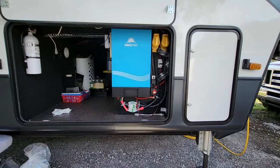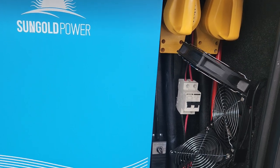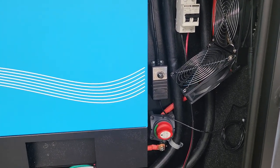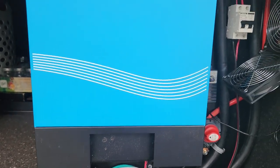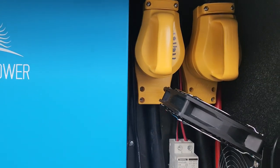This is the way it looks from the outside — you're looking at the side of the battery compartment, and this is where the inverter is mounted, with all the plugs. This is right as we finished the installation, before a little cleanup. Here you can see the two main cables coming from the line and going into the trailer. That's the breaker for solar. Those are the fans to cool down the cabinet, the fan speed control, the power switch for the batteries, and the two breakers underneath the inverter — the in and out breaker lines for the inverter, 50 amps.